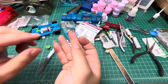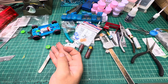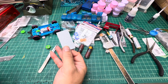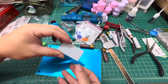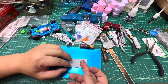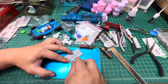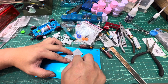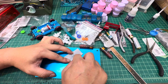First option: on one of the roller spacers, remove a little bit of material. Get a piece of sandpaper — at least 1000 grit. Set the sandpaper on a flat aluminum board and start sanding to make the spacer a little bit slimmer. The best way is to use tweezers, hold both ends of the spacer, and move it left and right so it slowly sands off the sides.